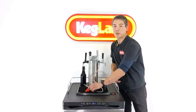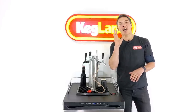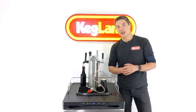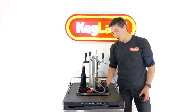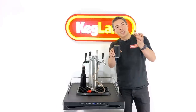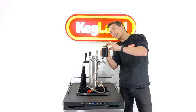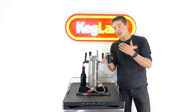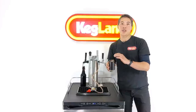That pretty much wraps it up for our NukaTap bottle filler. One question we had from customers though is: how come you don't have a counter pressure can filler? The reason is that can filling is quite different to bottle filling. Counter pressure is not generally done in can filling because we generally cap on foam. We fill the can up to the top, and as you can see there's a large amount of foam on top. When I get the cap and push it on, that foam essentially is overflowing out of the side, and that's what's evacuating the oxygen out of the headspace. So counter pressure can filling doesn't actually make a lot of sense, which is why we don't really make any attachments for this device to counter pressure fill a can.